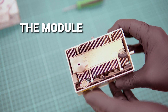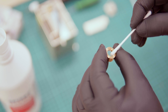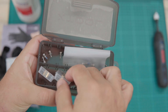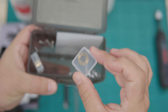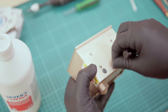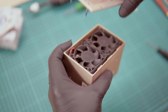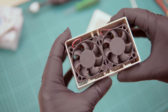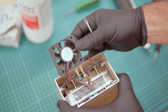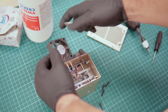Now let's go back to the laser module. I use fresh q-tips and alcohol to clean the lens and the glass on the front. Clean the lens cap too and check for any scratches or cracks — X-Tool includes some spares in the original box, and if you've misplaced them, they're easy to order. I'll drop the link below. I also blow air through the internal fans to clear things out, and I take the grill off to get in there and clean the fan plates, being very careful. Some people just do it on the surface, but I tend to pull it out — it's a lot easier to clean that way.